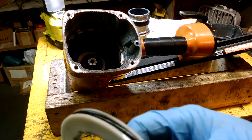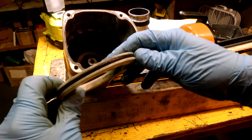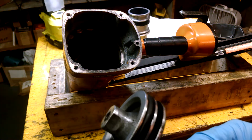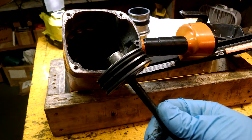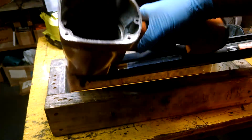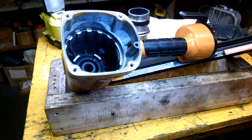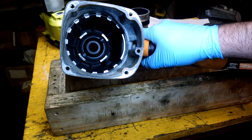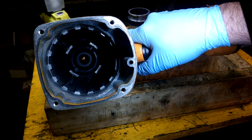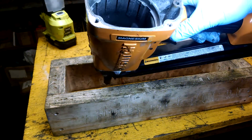I don't know if that's oil or residual grease. It could be. Looks more like broken down grease on that O-ring. And that O-ring is just bone dry. Never seen a nail gun this dry. They will not dry out this much from just sitting around. Yeah, that's bone dry. There is residual grease in there, a little bit here and there, and the rest of that blackness is actually rubber deposit, and a little bit of grease as well.